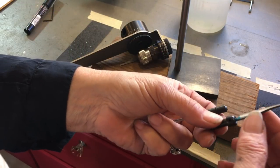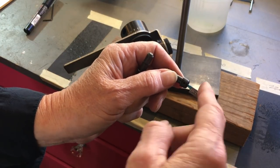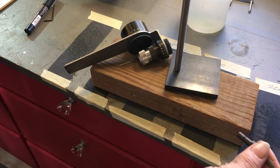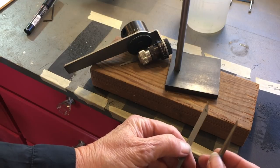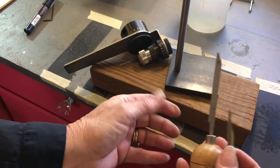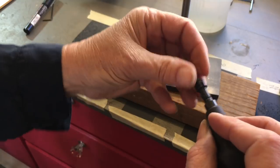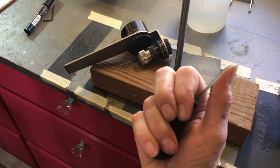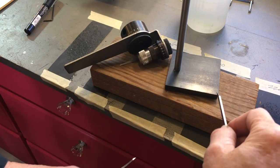Another thing I really like about the GRS system is that they pre-cut their gravers — they've already made this area here, whatever it's called. They're short, which is really nice because this graver has to actually be cut down, a handle shaped here, and more of a cut-out done on this part. This is unusable at this point — it's just so far away from the correct hold. With the graver, you want to have the blade right like that on your thumb, so you can actually have control over what you're working on. Compare that to trying to control the tip.